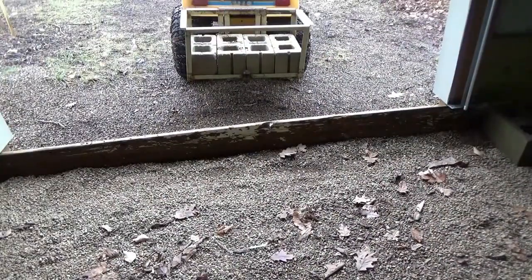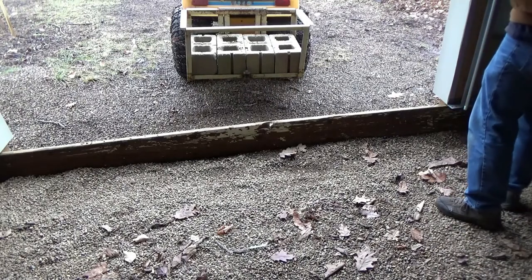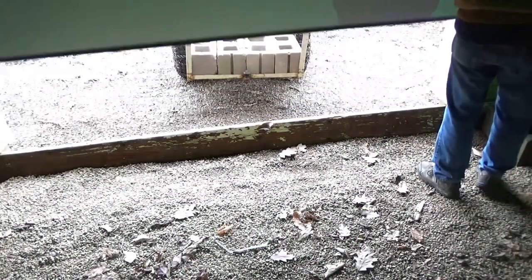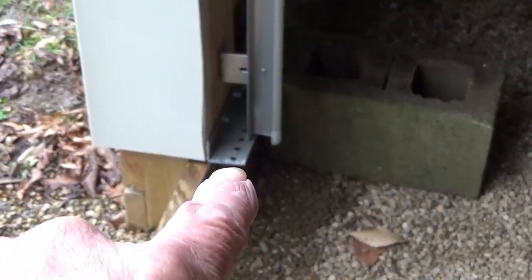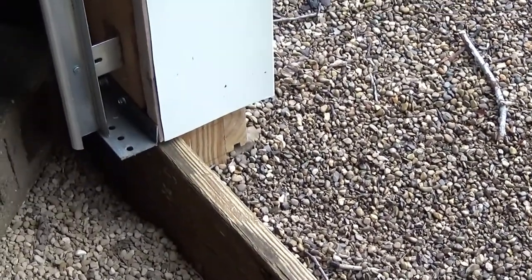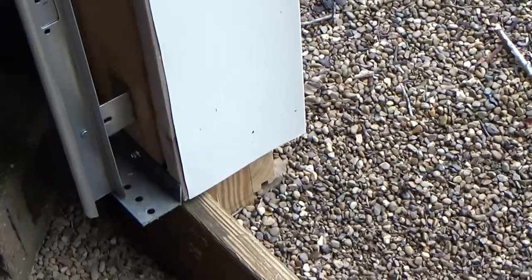We're going to bring her down — let's see how it looks with the door down. One thing that I've seen — I'll show you here — I'm going to have to do something. If you look right there where the board is, and out here is where the door is. So I'm going to have to put something behind that post and behind this post, which will be an easy thing — just a matter of a two-by-four or two-by-six or something. Then that way this board will come out to be right underneath where the door is. We're going to do that now and we'll be right back.